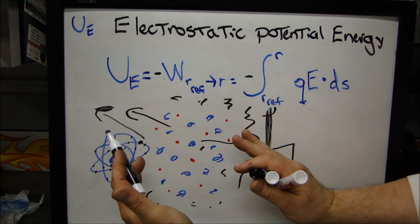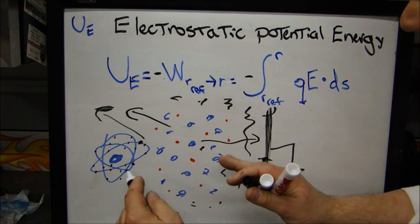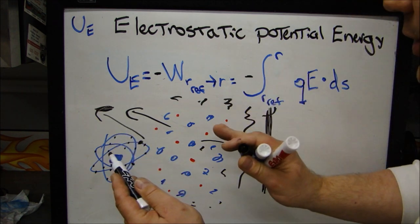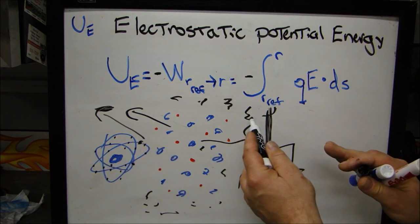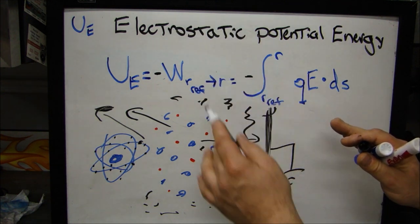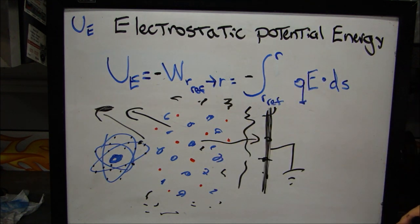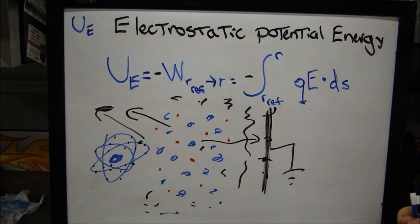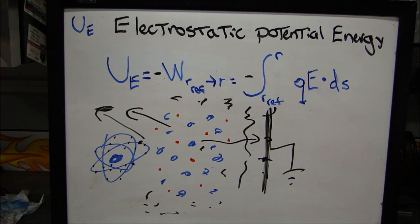You have a mist, a cloud of powder. The powder has ions in it. The ions give extra electrons to the atoms and molecules of the powder in the air. The powder wants to get rid of that electron, so it flows through the air in the presence of an electrostatic field, gets to the part, and wants to get rid of that electron — that's why it sticks to the part. Now that everybody's completely satisfied — or maybe said 'holy crap, I forgot all about differential equations when I left college' — that's how it works. Let's go coat a part and you can see it in action.